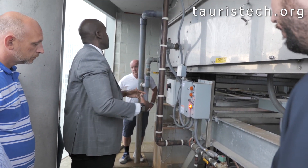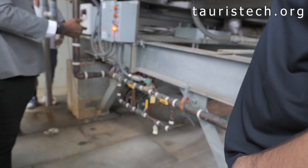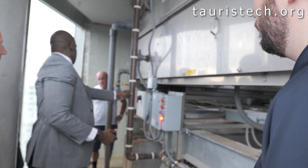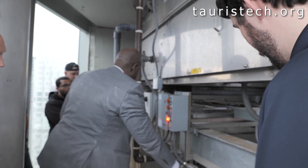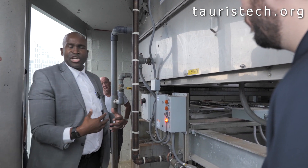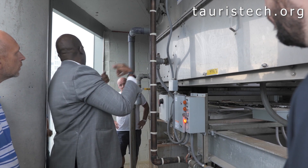The problem we have is eventually the water would just keep evaporating and there'd be no water left. So this line here is basically tap water — this is a makeup water line. We have a fresh water supply going in there, and there's some type of sensor on the inside that is monitoring the water level. If the water level goes down, it adds new water.